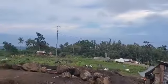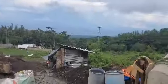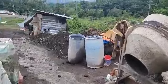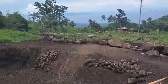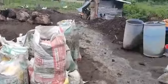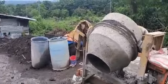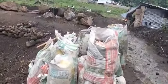Today's day three of construction, so I'll give you guys today's update. I wanted to show you the cement mixer. What they do is they sack up the sand and the gravel — we get truckloads delivered, it gets put down there, sacked up and brought up here. Then they have the water and the Portland cement, so they put a bag of Portland cement, so many buckets of water, so many sacks of sand, and so many sacks of gravel.